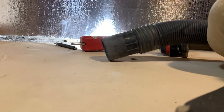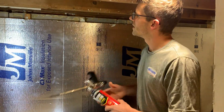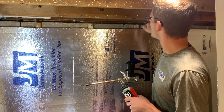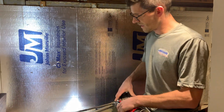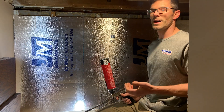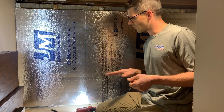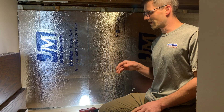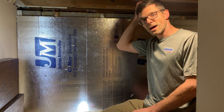I've already shoved some fiberglass insulation down all these block tops, and I've trimmed this up with the sawzall so I can get access to seal that gap. The reason we want to seal that is to increase the energy efficiency of the radon system. If I didn't do that, it would be pulling conditioned air from the house — air that Cali's paying to heat and cool — down these cracks and openings into the radon system and exhausting it.